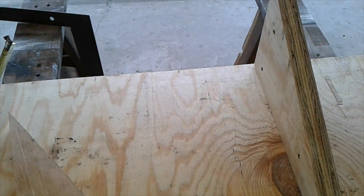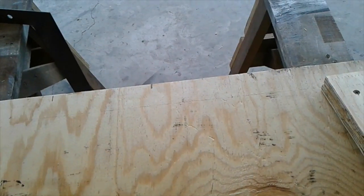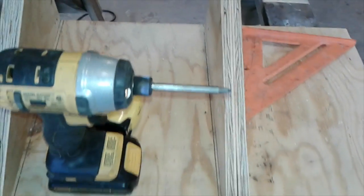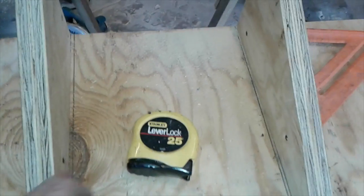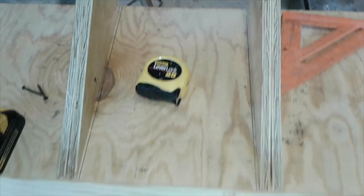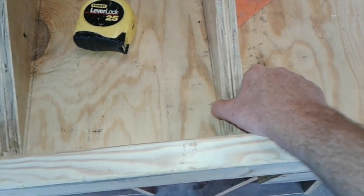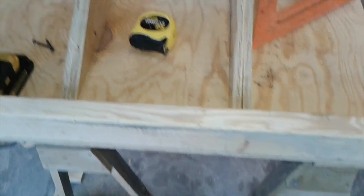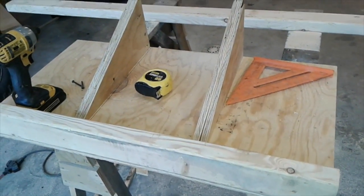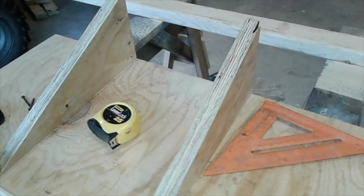I'm going to take my two-foot square, measure over a half inch, square a line down through here, and put screws in through the other side. I messed up at one point — these were way too wide, about a half inch. Measure carefully; I was in a hurry. I took out a few screws to fix it. It would probably be better to glue these or use a solid hardwood like oak. I have no confidence in pine — cut a pine board at an angle and start putting screws in it, the grain causes it to split.